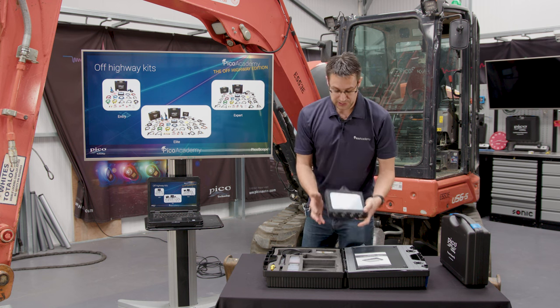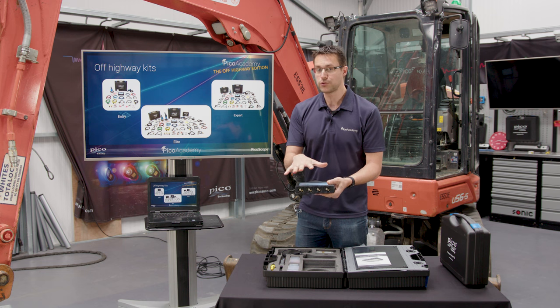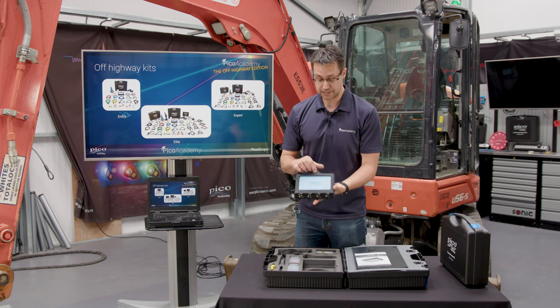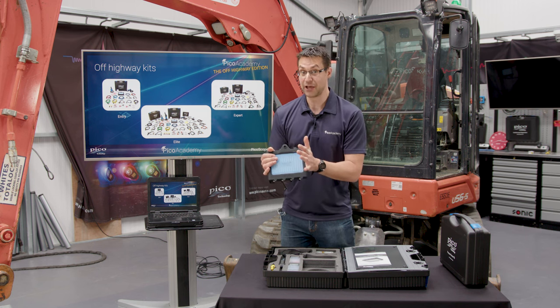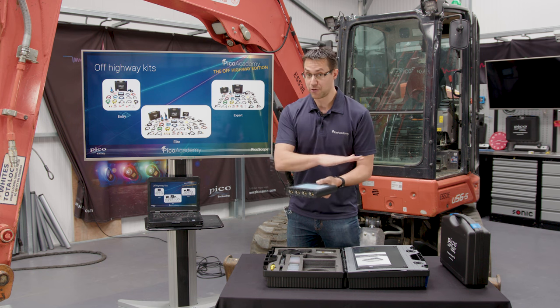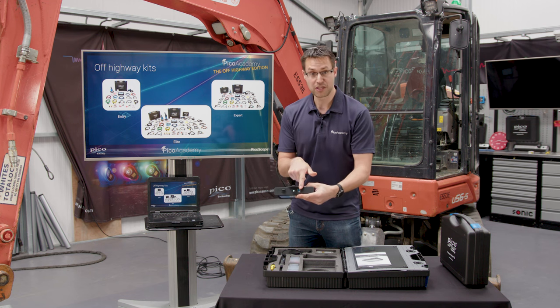The big main differences are the boot itself and the scope. The scope is still the normal 4425A automotive scope, a four-channel scope with Pico BNC Plus, but obviously you have a slightly more protected boot. On the top, there is like a silicone lid. It's not IP rated, it is better protected though, okay? So just bear that in mind. Other than that, the scope is exactly the same underneath, so still USB 2 and USB 3 at the back.